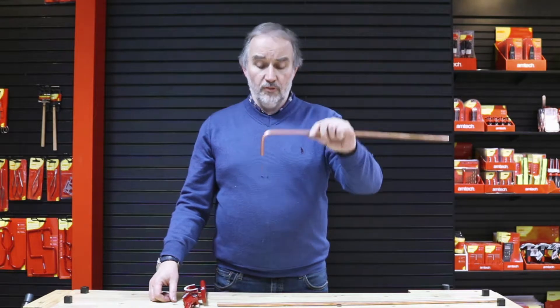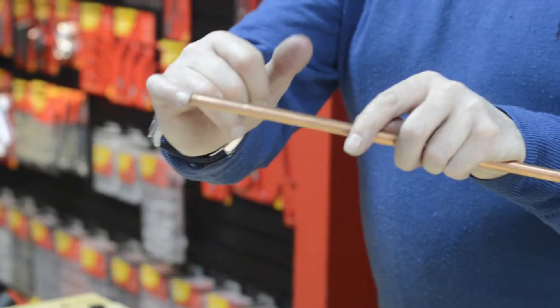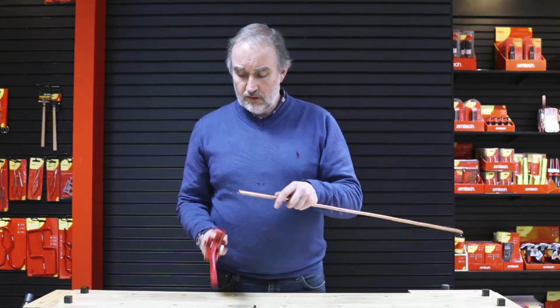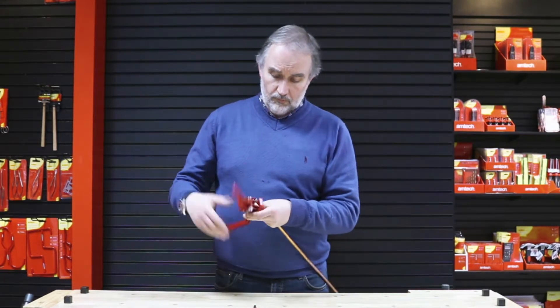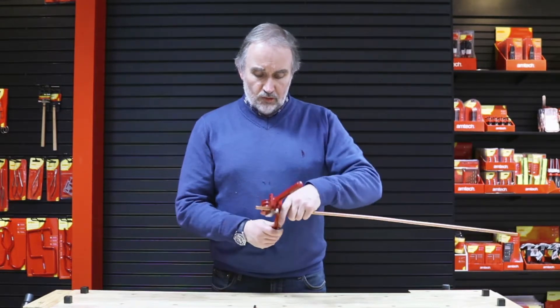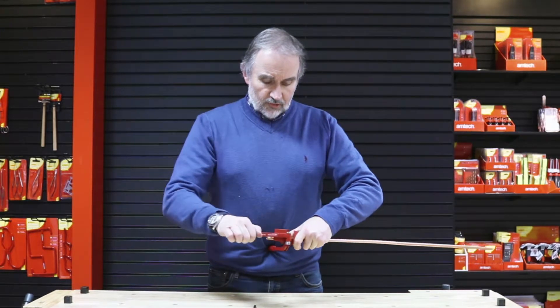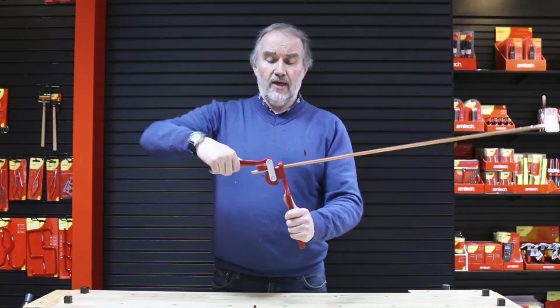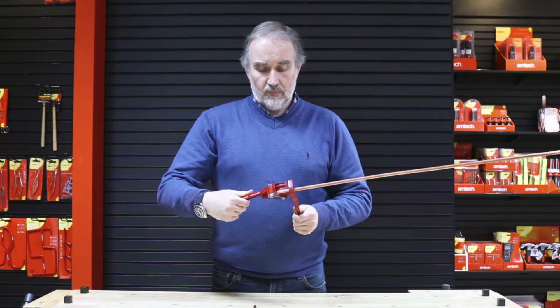You can see how quickly I performed that. If I just go to the 10mm - this is a bit tougher to do because the wall thickness on the 10mm is a bit more solid. Again, put it into the tool, open the top handle up, go into the 10mm channel, close it round so it's caught like that, and now again just gently bend it.